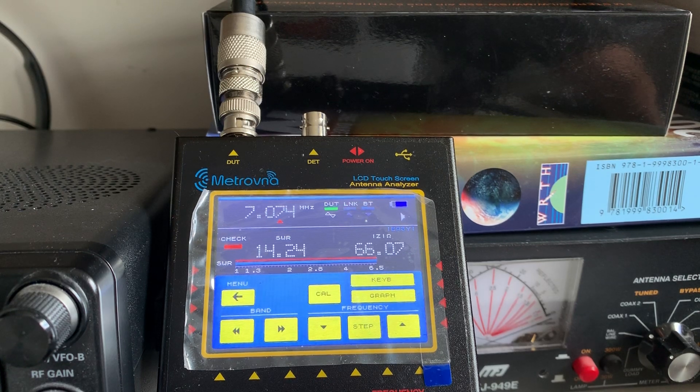Let's adjust the inductor. I've gone to I14, H3.0 — so let's try H. Now I'm adjusting transmitter and antenna again. Reading: 2.1, 2.0. Now the antenna — 1.8, 1.7, 1.6, 1.3, 1.2, 1.1. Then back to 1.2. Getting very close.